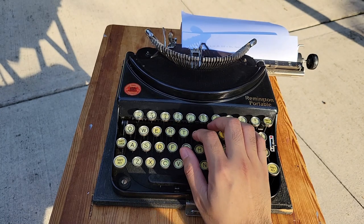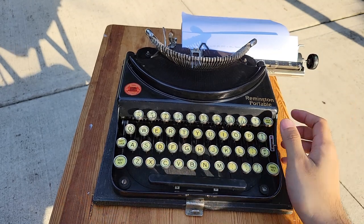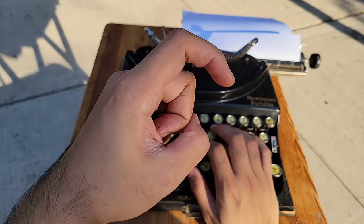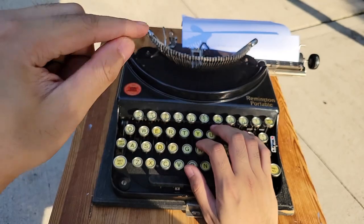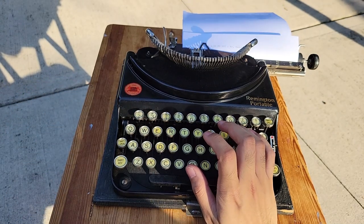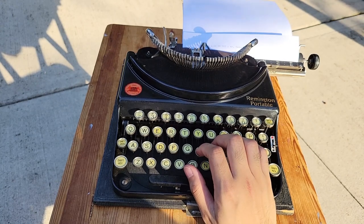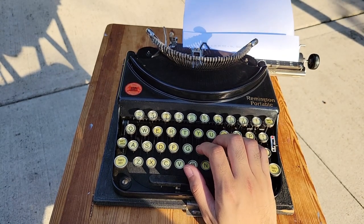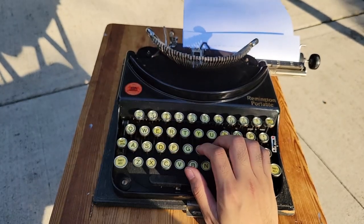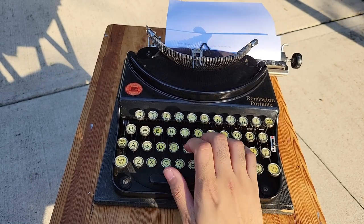These machines, this particular machine as well as the Royal, it's a bit harder to describe. It's probably closer to linear, but a lot snappier. And by snappy I mean it's kind of like this basically, or more Gaussian. Meaning that as you press the key, you're accelerating the action, but the action, to an extent, is able to maintain its momentum while your own finger decelerates, causing the force to decrease a bit during the stroke. That makes for a snappy feel, as well as a snappy sound.